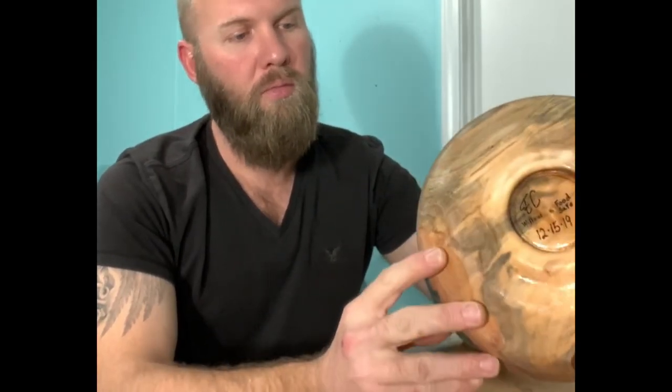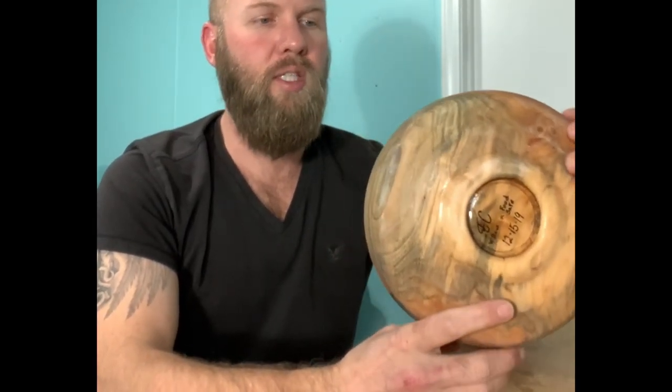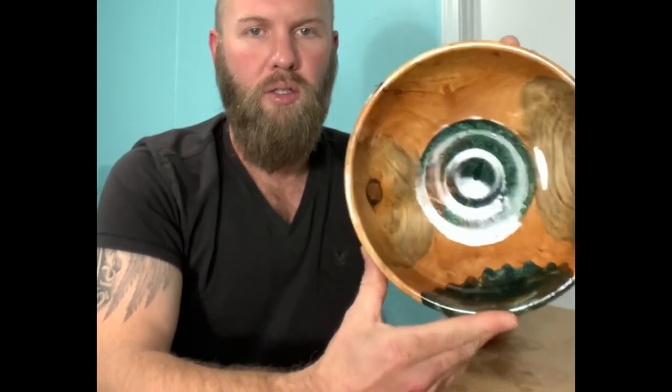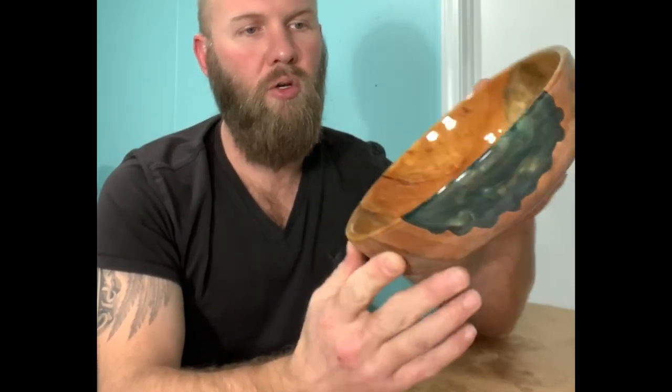What I'll do is keep adding layer after layer, and once I get it to where there's a good thick clear layer on top, I'll sand it down with fine grit to take the little nibs and rough spots off, get it nice and flush, and start reapplying. It's a nice food-safe gloss finish. It can go over epoxy, it can go over anything — you can put it over the top of anything.